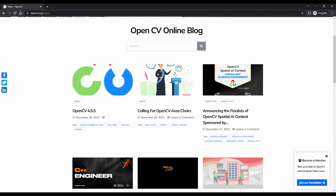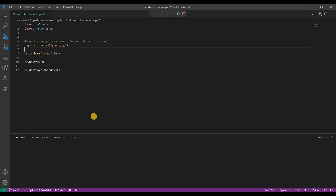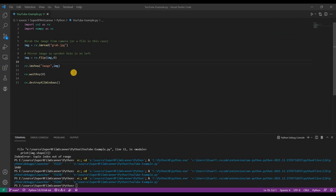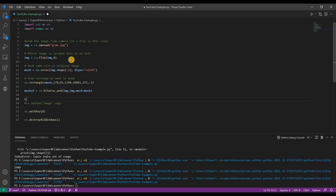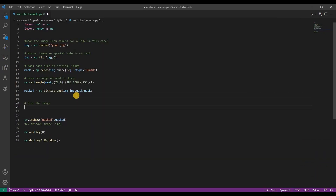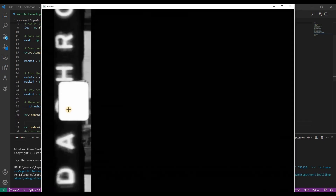I'm using OpenCV to analyse the image from the USB camera. It will detect the sprocket hole in the film and then use a stepper motor to align that sprocket into the centre of the gate or the capture window. So first we capture a single image. We can apply a mask to the image using OpenCV, which removes part of the image we have no interest in. I want to apply a mask to remove everything except a thin line of the sprocket. After applying the mask, we blur the image so the colours merge together to make detection easier. We also make the image grayscale, which is easier to process and requires less CPU. Using the OpenCV threshold function, we can strip out all the parts of the image we're not interested in, keeping just the sprocket hole.